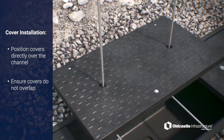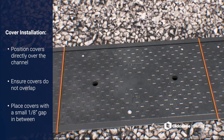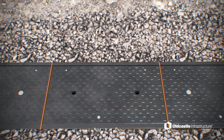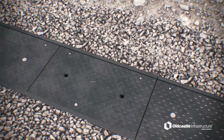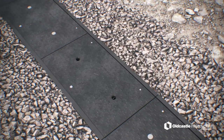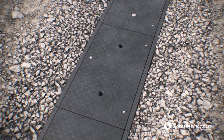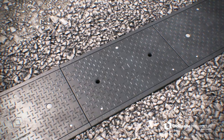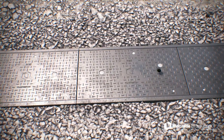Covers should be placed with a small ⅛-inch gap between each one, so that covers do not jam, and so that single covers will never overlap two trench bodies. Pay close attention to project drawings for the location of any mitered covers. Placing them in the wrong location will often lead to overlapping covers somewhere else on the trench run. Covers that overlap trench bodies often lead to future performance issues. Plug lifting holes with provided lifting caps.